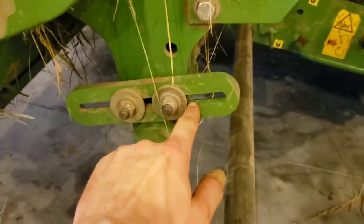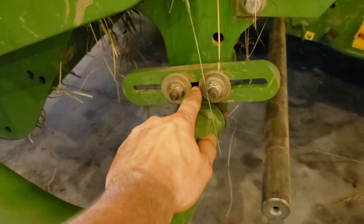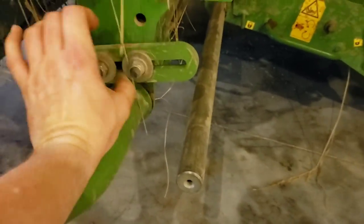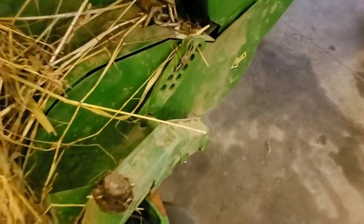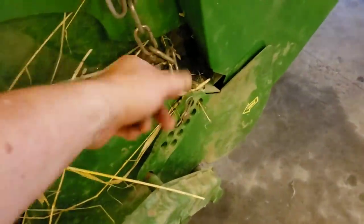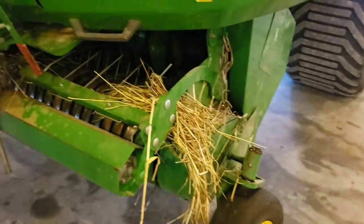This Krone uses a slidable piece, which is a little difficult to set. The newer high-speed versions use a saw-tooth piece with a quick release pin — you move it how you want on the saw-teeth. The John Deere is the same, with holes in half-inch increments for the gauge wheels. Then you have a chain that does the same thing as that slidable piece. The problem with the chain is it's not as finite an adjustment as the saw-tooth piece, but it's much easier to set if you're going to change drawbar heights.